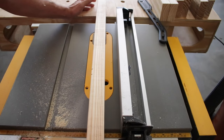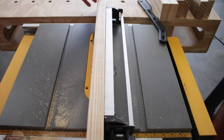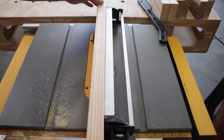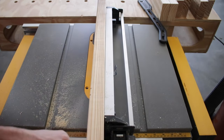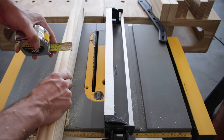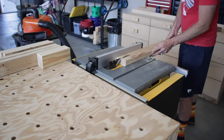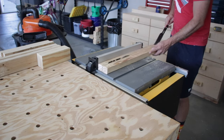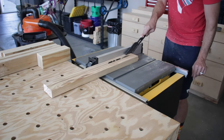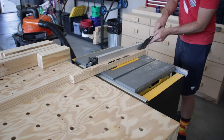Since I want my legs to emulate that metal tubular pipe look, I wanted them to be square on both sides. So I took my two by four and turned it over to use the width as my gauge so that I could rip them down to exact squares. The measurement checks out, and now it's time to start ripping these down — just ripping the two by fours and turning them into nice square tubular shapes. And yeah, if you get a good look over there, you can see my awesome Houston Astros baseball socks — repping them hard today.